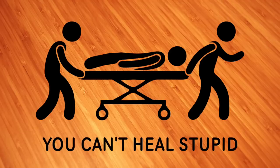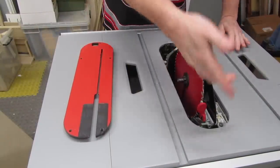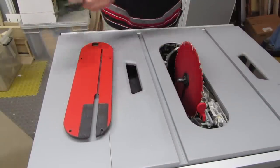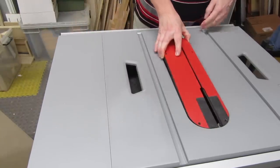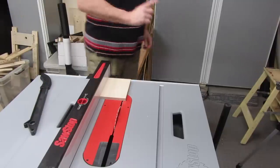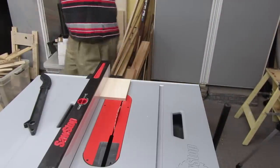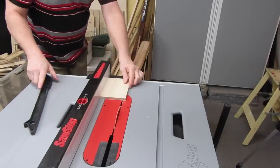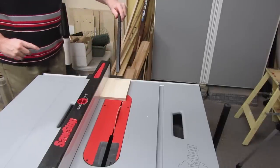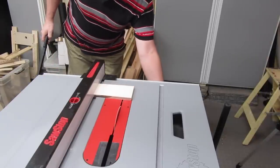Then let's apply what we learn. I'm removing the riving knife from my table saw. A riving knife would make it harder to generate the kind of kickback I'm going for. I'm not saying that you can never get kickback with a riving knife, but it's certainly less likely. This is my first attempt, and I almost forgot to get my face shield. Think it's not necessary? Think again. Look at me lean across to turn on the saw. I'm scared of kickback and I haven't even turned on the saw yet. That was footage from my first attempt, which failed to generate kickback.